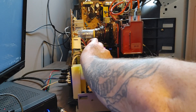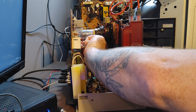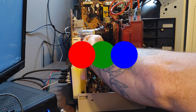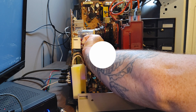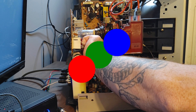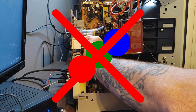The first step is to go on the neck board and set your H-stat — your horizontal static convergence — and that will adjust things horizontally. You want to try to bring those red, blue, and green beams into alignment or into convergence first, and this might be all you need to solve your convergence problems. It's when you have a vertical separation that you cannot fix with the H-stat — you'll have to adjust your rings.